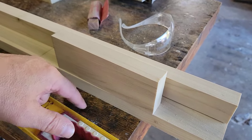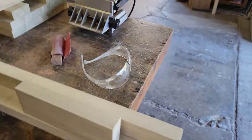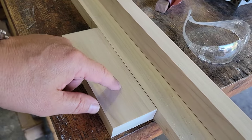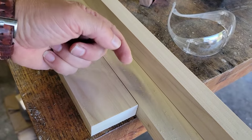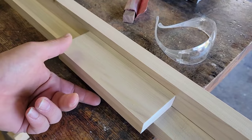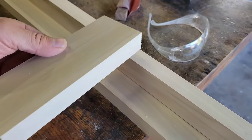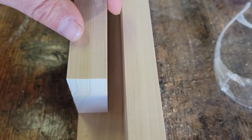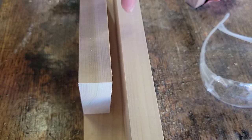Typically you'll bolt your hinge here, and there'll be a cup on the back side of the door. The door rails are all an inch thick, so the door will lay in here and swing out. You'd have a hole here for the 35 millimeter recess cup on the hinge, and you need a place to mount that hinge. These scrap blocks may be what I need — maybe I'll rip them down and that'll be thick enough. I'll know when I get the hinges. I might have to orient it differently or do some creative shape. I can mill something up to fit tight — there are a half dozen different ways to do it. I'll solve that when I get to it.